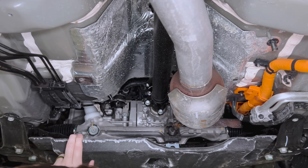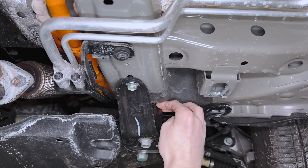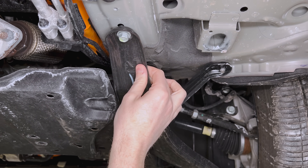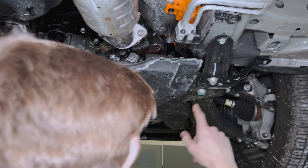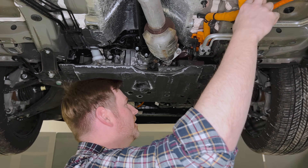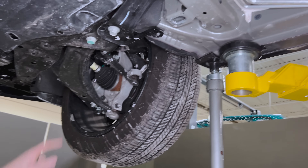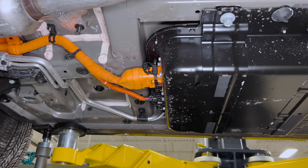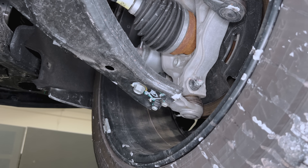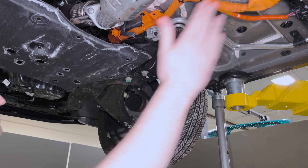Looking forward from the rear, this is a fixed — actually it might be isolated — we do have a double-shear bracket here. In PIA or part-and-assembly markings, we typically see quality check marks. There's not a lot throughout the vehicle, but there's a ton on this ball joint specifically, which makes me wonder if they had an issue and they're checking it three times. We saw a lot of this on early Rivians where people were clearly going through and checking welds and assembly points — not uncommon on early vehicle builds.